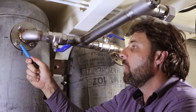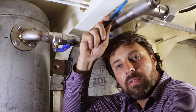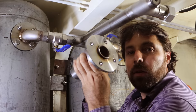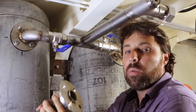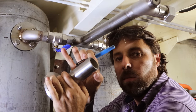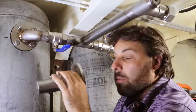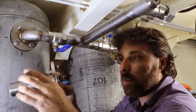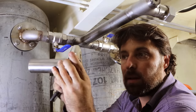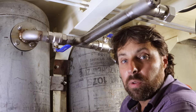Manifold back on, bolts are nice and tight. This is where it's going to be sitting permanently. I've got the little bracket up the top here that holds this end of the manifold pipe. I need to figure out where this flange is going to sit in the tank. I'm not going to cut a hole that's absolutely bang on for this diameter — I'm going to give myself a couple of millimeters of wiggle room. So if I can cut this with a wee bit of clearance, feed it into the tank and bolt it up nice and tight to this flange here, then I can mount it exactly where it needs to be for the manifold and take it into the tank itself. The tank is basically bolted solid — it's not going anywhere.